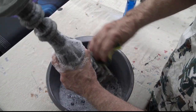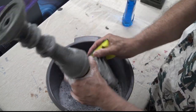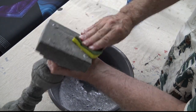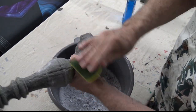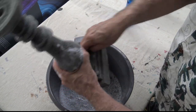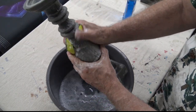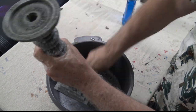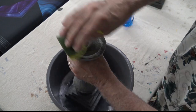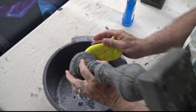Right now we have the foam mold and we're washing it down. We're going to use an alkaline soap to do the cleaning initially, and it is totally okay to get these wet, get it into the nooks and crannies. It's totally okay to have the soap soak into it. It's all about getting the paint to stick to foam.